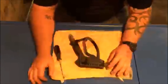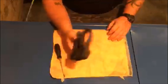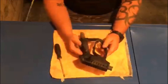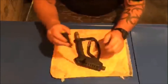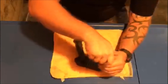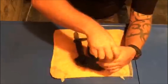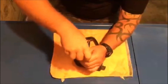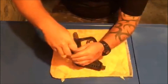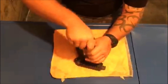Hey guys, Troy from Washerite Hamilton here. I'm going to show you how a standard gun works. This gun is quite old — it broke and stopped working maybe 12-15 months ago, which is why it still has the old fittings on it. We'll pull it apart; there are just some basic screws that hold on the plastic cover. Beforehand I sprayed all the screws with a bit of penetrating fluid — CRC or WD-40 works really well, considering these guns were spraying sodium hypo and do rust a little bit.